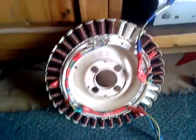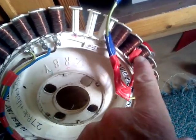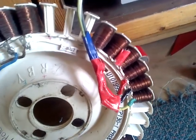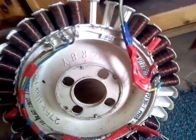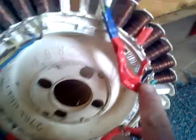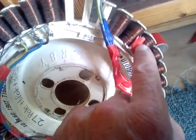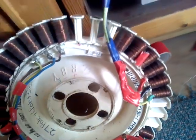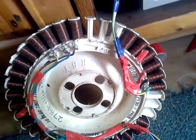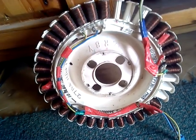Now I'm smack bang in the middle of actually doing my windmill build right now, but here is 6 poles wired in and then tied off at the end. Now this is one group, and I wish I could help you as much as I could, but when you tie off, this is one group of 6, okay? When you tie off another group of 6, there's obviously got to be a starting. This is the starting, this is the ending, where the last 3 groups of the wires are soldered together and insulated by the tape. But what that diagram explains is 6 groups of those that you can fit into the whole lot of the 36 poles that are sitting here right in front of you.